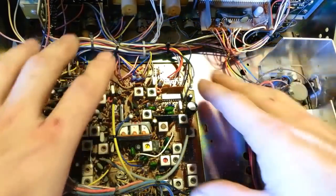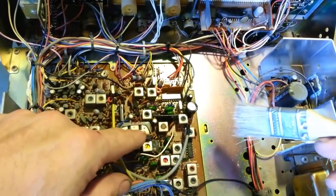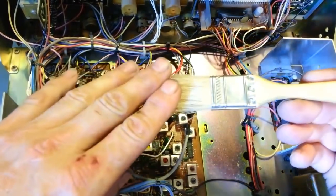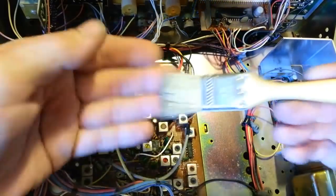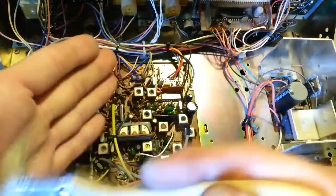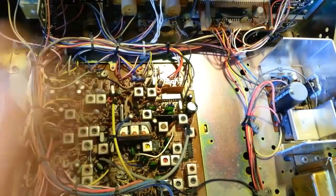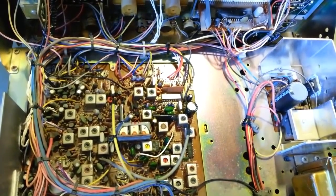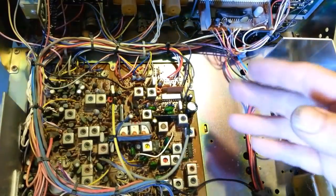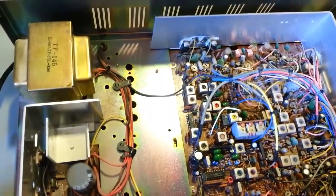So liquids are not a good thing. Worst case scenario you get a gummy oily residue on the board. What I'll do in that case is dampen my brush with a little alcohol, brush it, and then brush that off on a microfiber towel — redampen it and just use the brush. I won't saturate the actual top of the board.